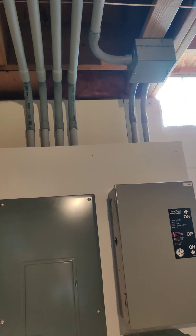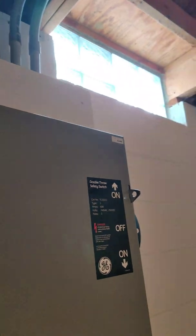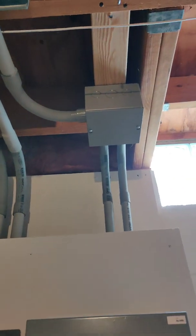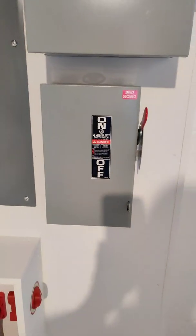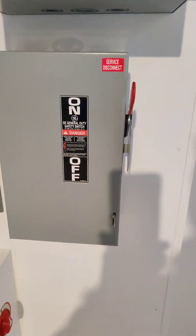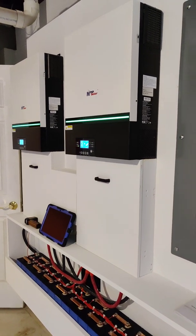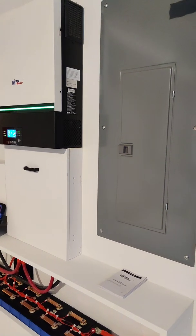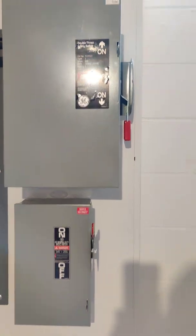I've got a little room for expansion here. My number six feed is coming into that six by six up there, and I've got it paralleled, coming down to this disconnect here which isolates the line side of both inverters. I wanted a way to work on the inverters in case there was an issue or I had to service something without being completely out of power.